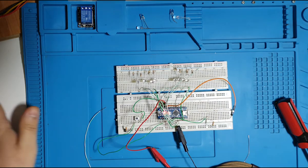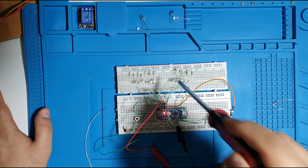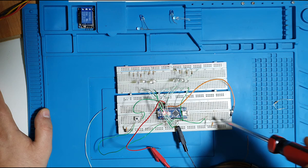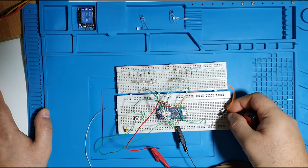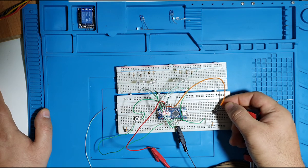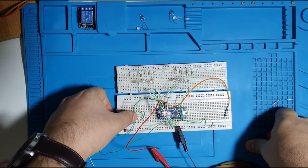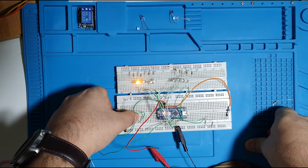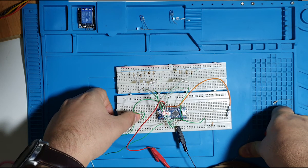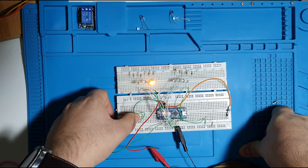I've uploaded the code. These four LEDs are connected to one button, and another four LEDs to the other button. I don't have an additional button here, so I manually short the contact to simulate a press. The first press turns on the first LED, second press the second, third the third, fourth the fourth, and the fifth press turns all LEDs off. This simulates switching through variable, 3V, 5V, and 12V outputs.